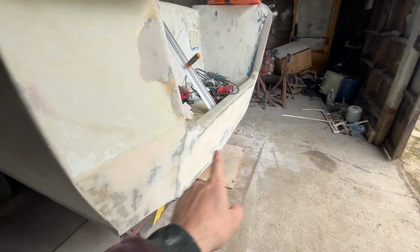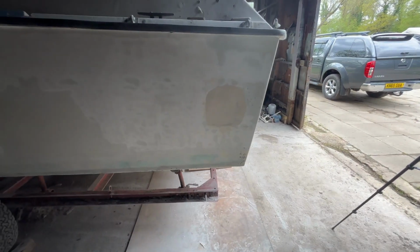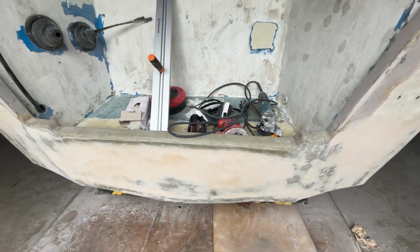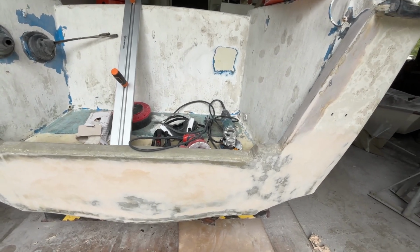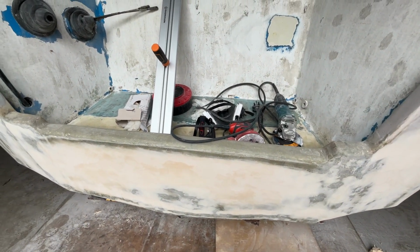But yeah, so what I'm going to start with is get the final fairing on there so that can start curing. I basically just try and get all the fairing on everywhere today, see how long that'll take. To be honest with you, I'm going to have to leave it anyway just for it to cure 100%, so I can come along with a sander tomorrow. But the main focus is trying to get this last layer on here as nice as I can. I know it's going to be sanded as well, but I think it'd be pretty easy. I think it says about 0.5 mil gap in between the ruler and this coat, so it should be nice, easy. We shouldn't have to use a lot.